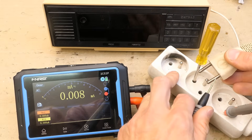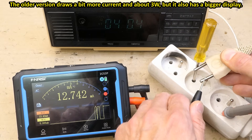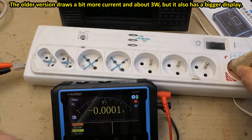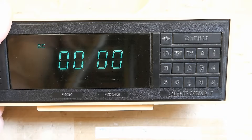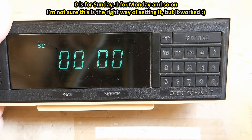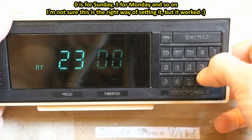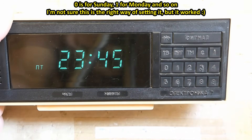Let's measure the power consumption of the fixed clock — about 12.7 mA, actually less than I expected. The DC voltmeter in combination with my wattmeter reads 2.3 watts, and with one digit more resolution using the 10 times more sensitive socket: 2.31 watts. The clock isn't really that dim outside of studio lights. To set it: press this button, then enter the day — for example 5 for Friday — then type the time, for example 20:40, and press enter. And it's running.